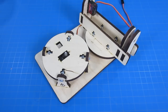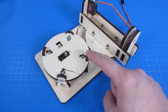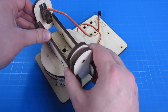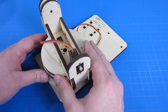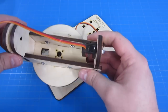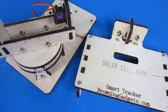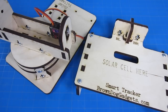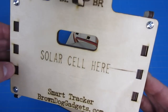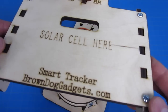Servos can only move at 180 degrees, so we have to home the servo so that our pieces correspond to where it thinks zero is. Place your center piece onto the servo, get it down there nice and snug, and then turn it counter-clockwise until it can no longer move — this is now zero. Take off the middle piece and put it so that the servo and the arrow are pointing in the correct direction. Now that is where zero will be and where it will start from once our program runs. Use one of your small servo machine screws to screw in the center to our base plate servo. Then do the exact same thing with our top piece and that middle servo — push it onto the servo and move it counter-clockwise until our zero position has that tray flat on top or slightly askew to the back.